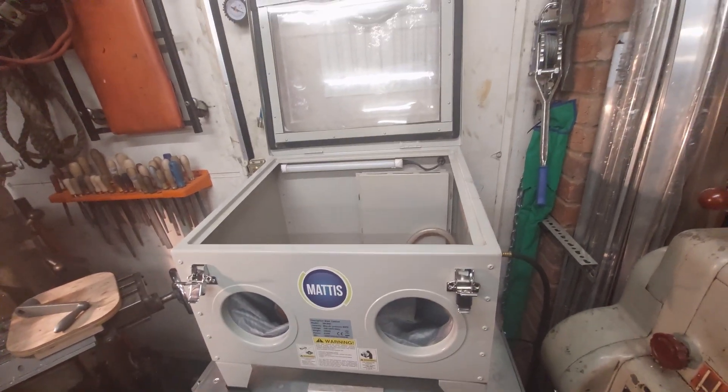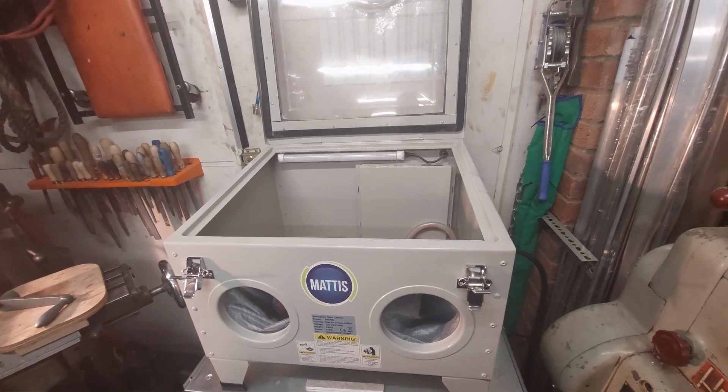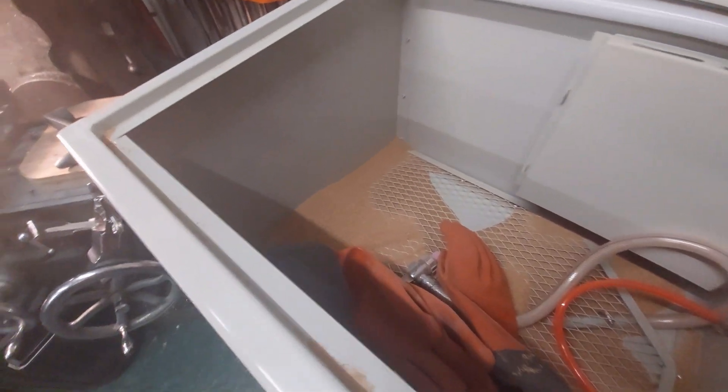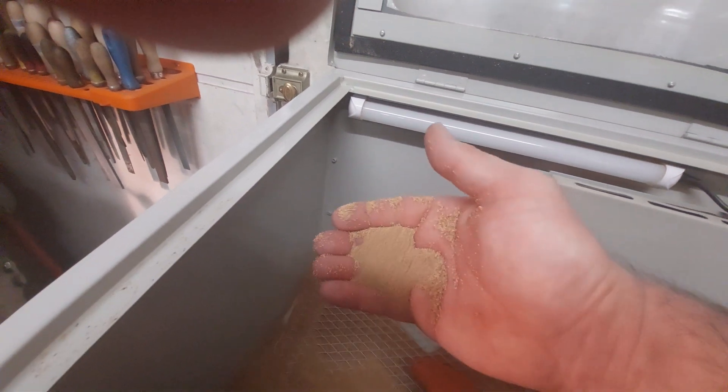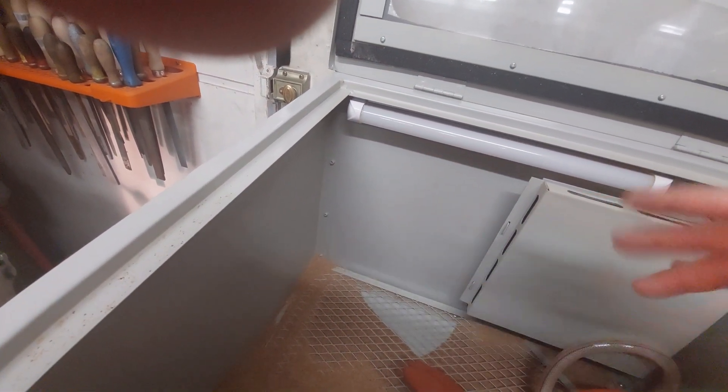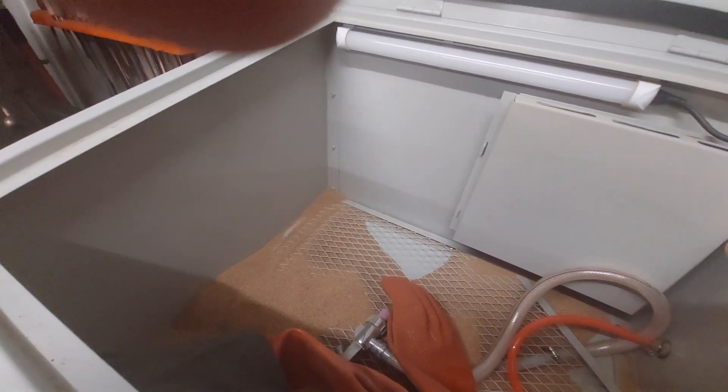What I'm videoing in here is some of my experimentation. Looking in here I've got a medium in there — it looks like a lovely colourful uniform sand. We call it sandblasting and this looks like the best beach sand you've ever seen, but it is actually crushed walnut shell. It smells fantastic — it's very aromatic. So I'm going to give that a test.